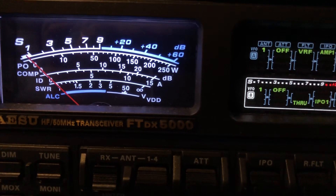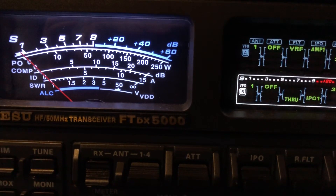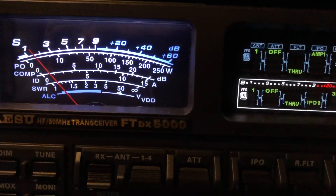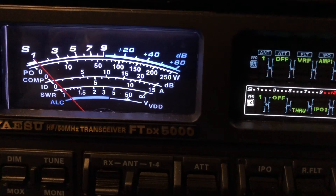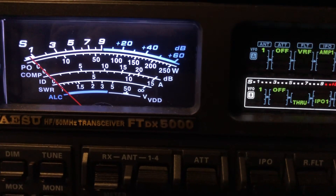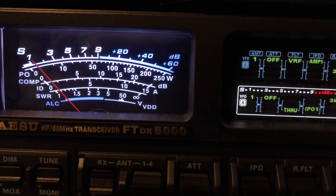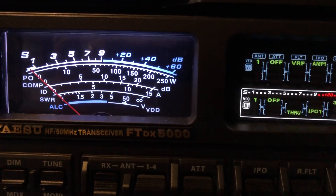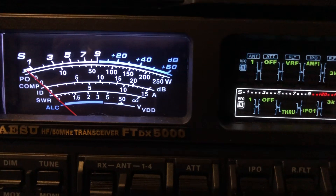The 2000, 5000, and 9000 feature this, and then there's the option to buy the external ones, which put this on steroids. I've got one ordered for 40 and 80 meters, so I'll be doing a review about it as well. VRF off — noise floor pops up. VRF on — noise floor drops, but his signal is still there. And like what I was alluding to: if you do have somebody splattering a little bit up the band, I could move it away from the signal up the band but enough to still hear the station I want to hear, and it'll also help knock out that interference.